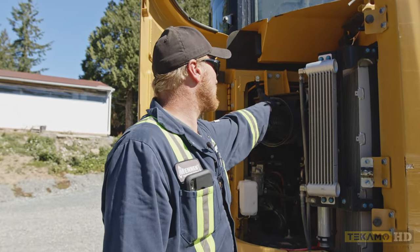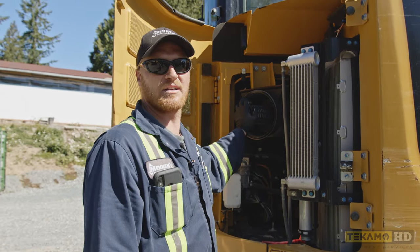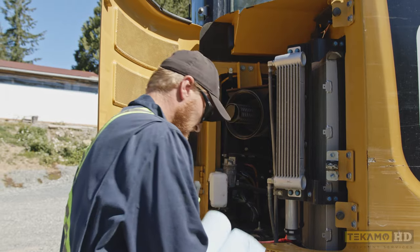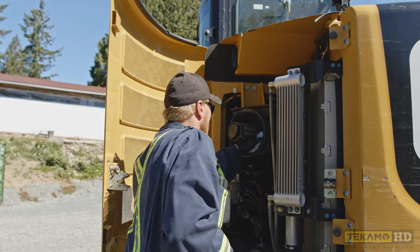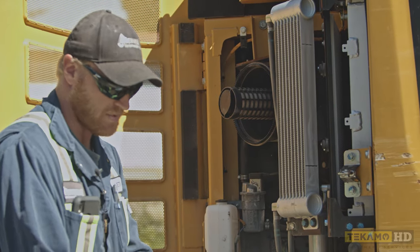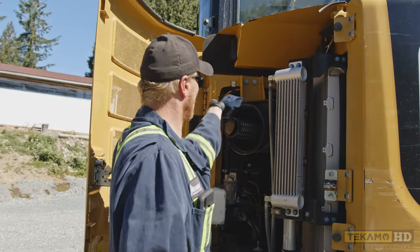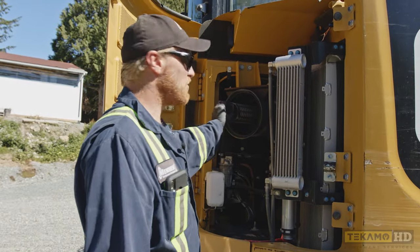Machines like this — a little bit of dust and dirt gets in here, settles off the air filter, makes it a little bit dirty. I always leave the dirty inner air filter or secondary air filter in just to make sure no dirty air can get past it while I wipe the canister out. As you can see, quite a bit of dirt and dust is coming out. Once that's clean and no more dust can settle down, you can pull out the inner air filter.